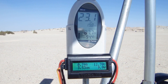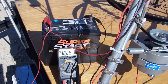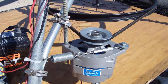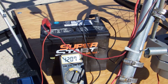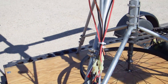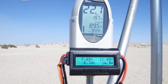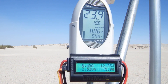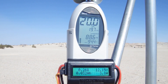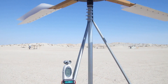While the battery is charging, let's take a few minutes to describe just what I've got here — you may be surprised to know that it's homemade. The blades consist of two-by-fours with styrene plastic panels mounted to them to form a 50-degree leading edge. The tower is made of galvanized pipe held together with hose clamps. The drive shaft is a one-half inch water pipe with an ATV hub welded to one end, supported at top and bottom by a couple of front wheel bearings from a 1972 Mustang. The bicycle wheel and generator pulley are wobbly because I'm just not good at that.